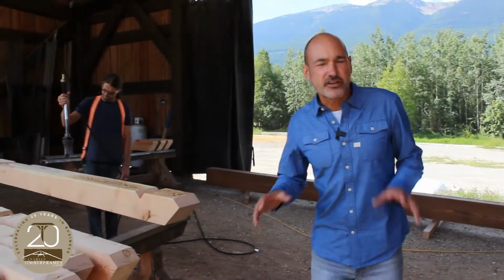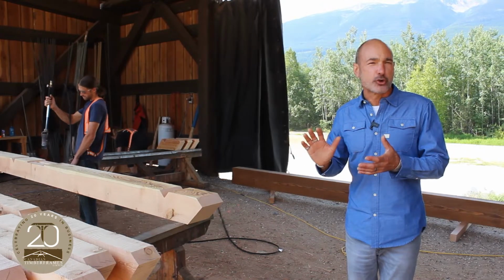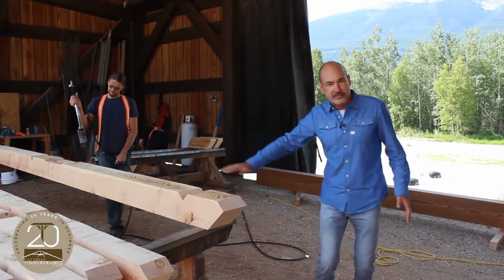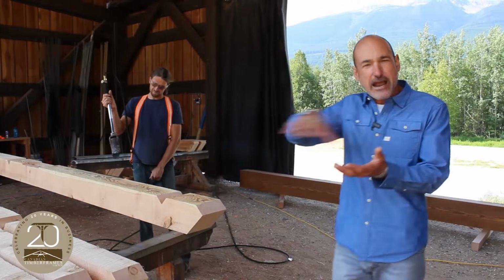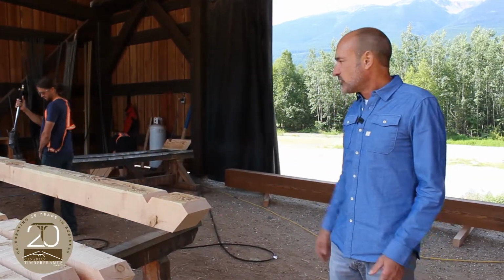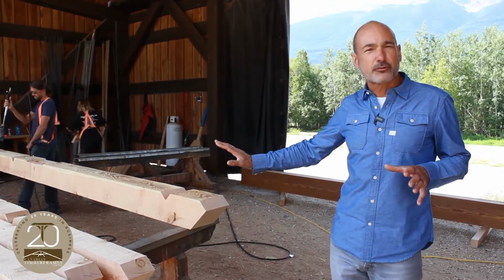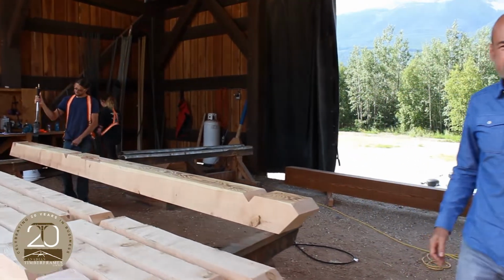The burning also gives us just a little bit more of the texture and the look of the grain. So we've got the flat grain side, but what really looks cool is when we get into a face grain side where we almost get that topographical map look on the wood fiber. So we'll go inside, look at some of your timber that now have been burnt and brushed and ready to be stained, and we'll look at the folks inside doing some staining work.